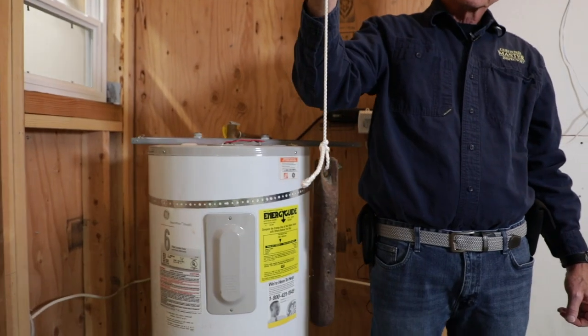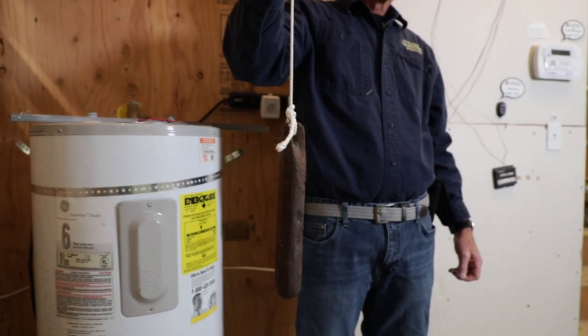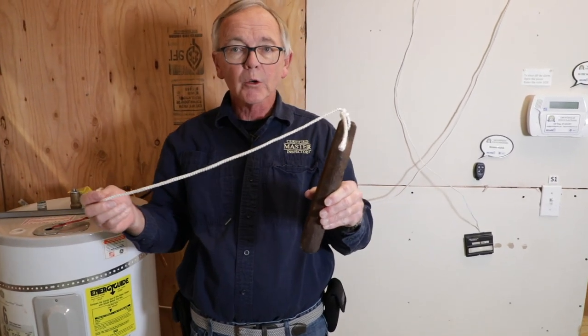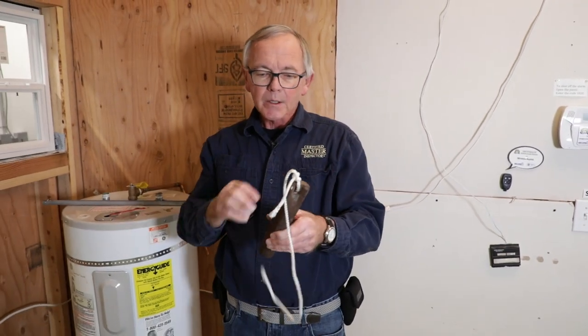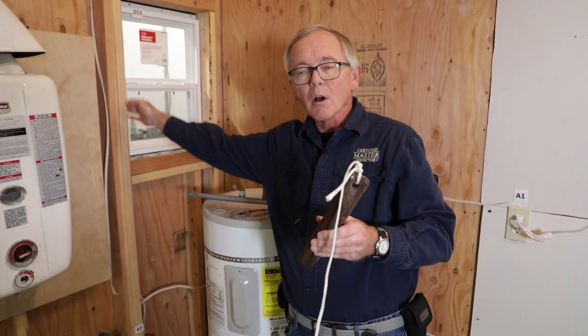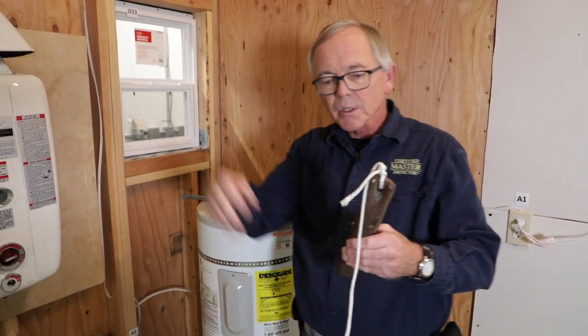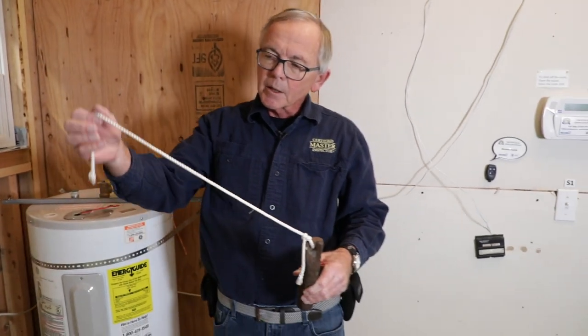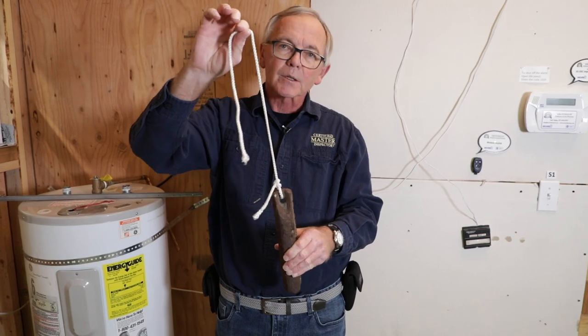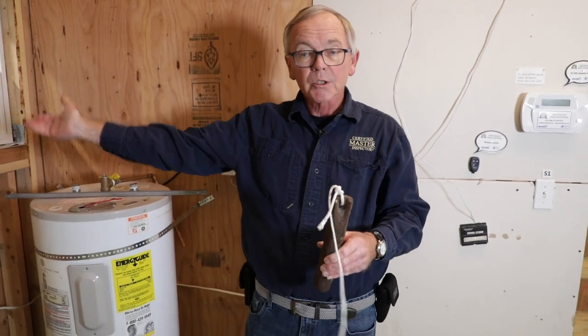There are other mechanisms as well concerning double hung and single hung windows. This being the counterbalance weight that you'll see in some older wood windows, perhaps from the 20s and 30s and 40s. And these actually are located inside the wall along the trim, behind the trim work. You never see these. But typically what causes these to go bad is the rope gets deteriorated and breaks. And then the sash won't stay up.